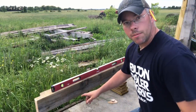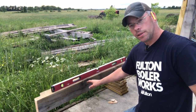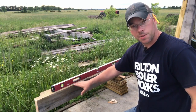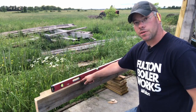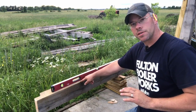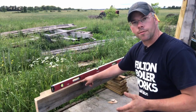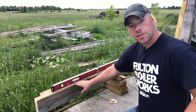What I'm going to do is take a 2x4 and I've got this level across. Something else you want to keep in mind: my first girt I make sure is super straight - no crowns, no bows. The ones after that, it doesn't bother me so much if they're a little bit off. I don't want them to be, but it doesn't bother me that bad.